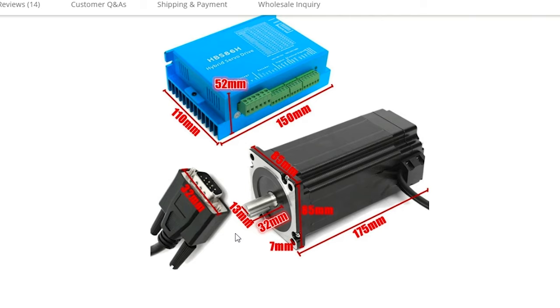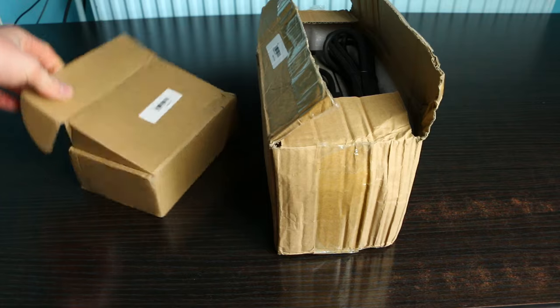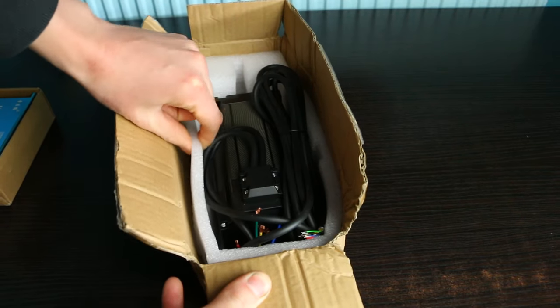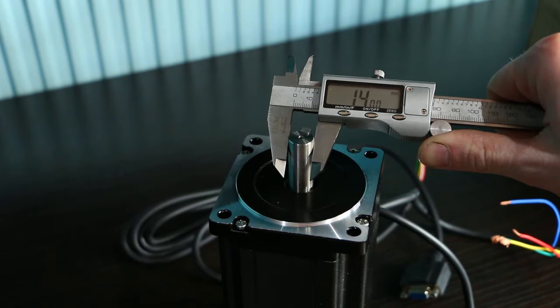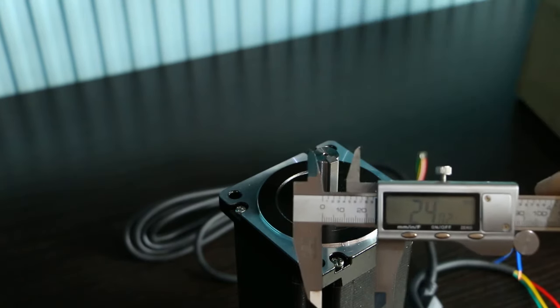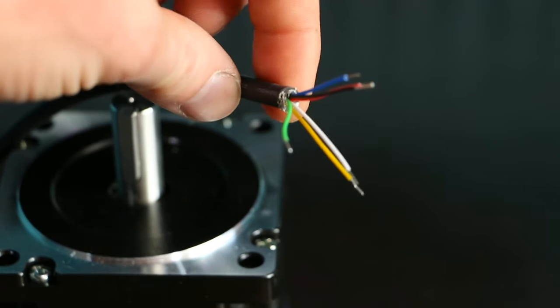Let's take a closer look at the motor to get things clear. The motor was delivered in a cardboard box and the driver was in a different box. Both boxes were wrapped in a layer of foam and then sealed with a plastic bag. The inside of the box with the motor had another layer of foam, and the top side had an additional foam layer. The motor has a 14mm axle with a 5mm wide and 24mm long key that sticks out 2mm. It weighs a little over 5kg, the encoder cable has shielding, and the motor cables don't.